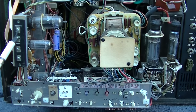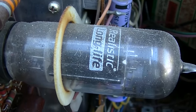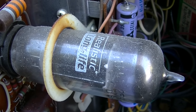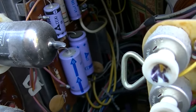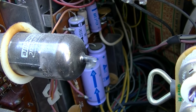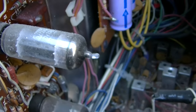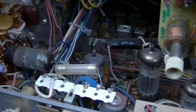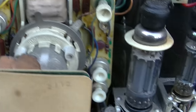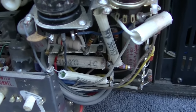Or is it? The first thing that catches my eye when I open it is this — Realistic tubes are garbage. And I thought these were Realistic lifetime, not long life. It's got the lovely leaky Mochizuki capacitors in it. Another Realistic long life tube — absolute garbage. Whatever problems it has, we're going to automatically blame on that. It's also got some of those purple oil caps in it — those are kind of garbagey.